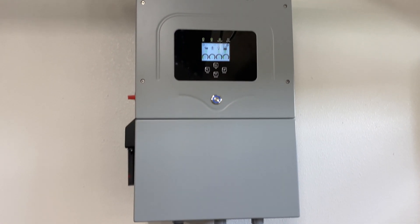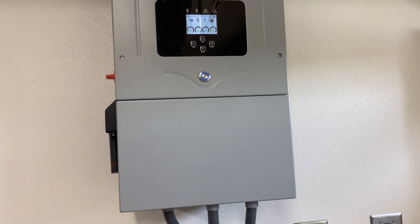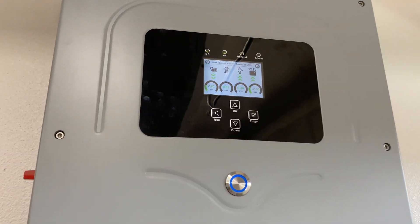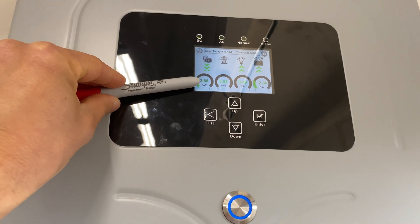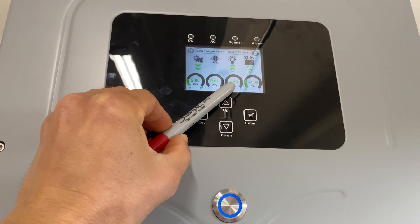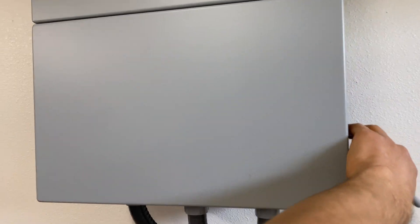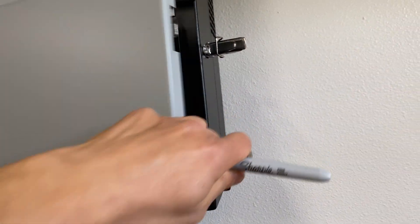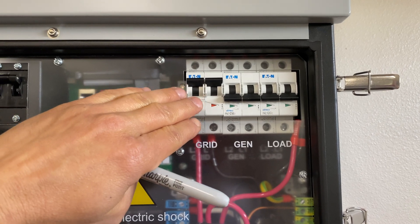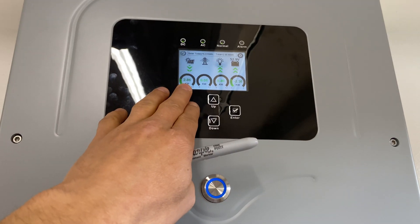The main component is this all-in-one solar unit. It has two MPPT charge controllers and can work in grid-tie and off-grid mode. Most of the time it runs in limited-power-to-home mode — right now my panels are producing 2.85 kilowatts, grid consumption is near 0 to 10 watts, and my house consumption is 0.4 kilowatts produced by this inverter with the rest stored in the battery. It has inputs for two MPPT charge controllers and circuit breakers for both grid-tie and off-grid modes.